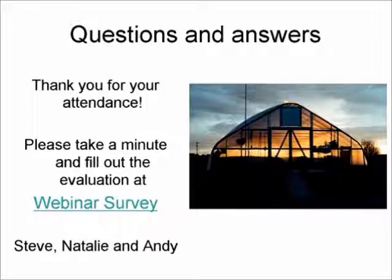Great questions. I think our time has expired, but we can hang in here a few more minutes. I would ask if everybody would take a minute to click on that webinar survey, fill it out, and get back to us — we'd appreciate that. Carl, on when to open and close: in Pennsylvania, if it was 26 degrees and snowing, there was no light to be gained, so everything stayed locked up. If we knew a storm front was coming through, even if it was cool, we aired on the side of ventilation to make sure the crops had adequate air exchange before the front came through and we got pounded for a couple of days with dark, dreary weather.